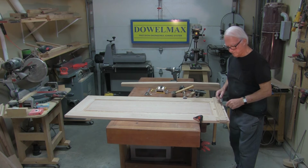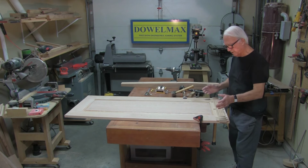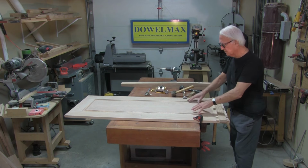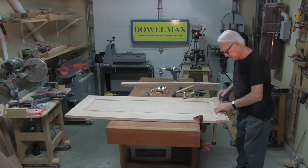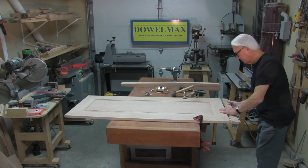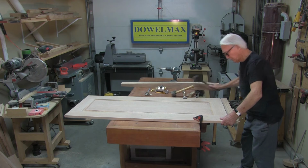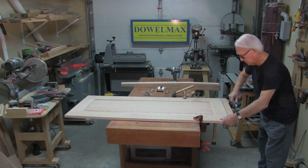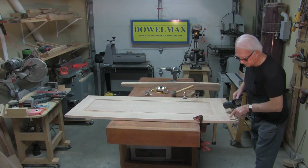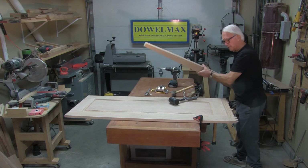We're now ready for the dry fit. I'll probably regret putting so many dowels in here because not that I won't get it in, I'll probably have trouble getting it back out again. This is all just dry fitted, so that's why it's clamped to prevent it moving too. Meant to mention, go back to your original marks before joining.